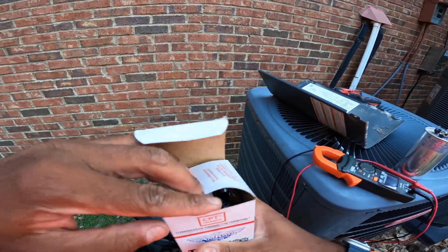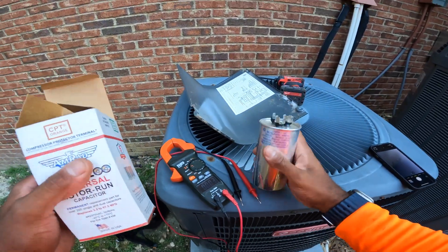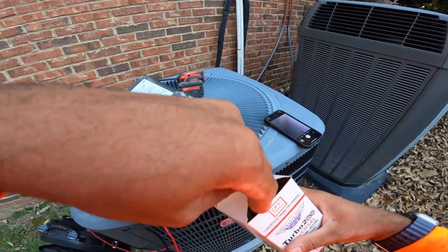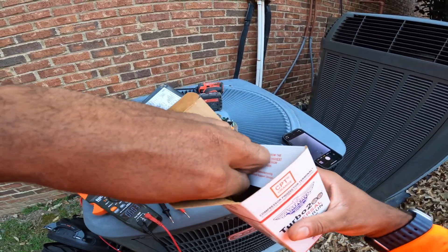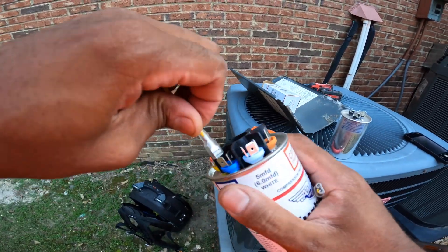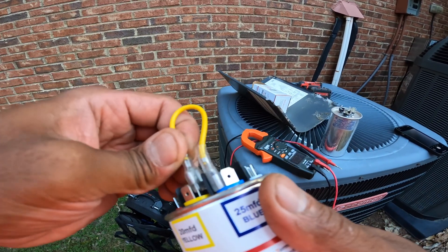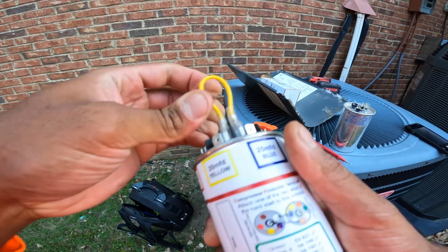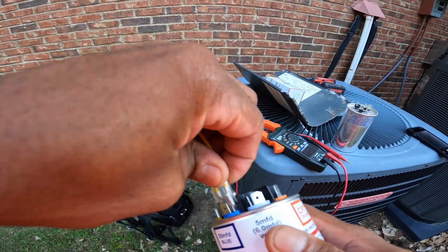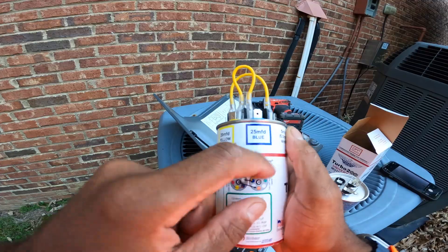That's the very bare minimum. I'm going to ask him if he has anybody doing maintenance here. This was rated 50 µF, so I'd need to jump this out with a 25 plus 20, which makes 45, and we just need five more microfarads. So we go over to the neighboring port — white — 5 added to that 20, that 20 added to that 25, to make 50.